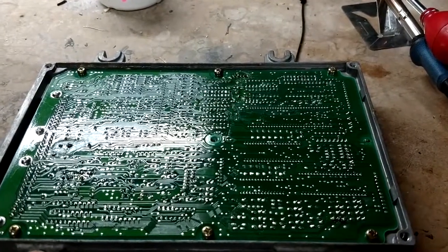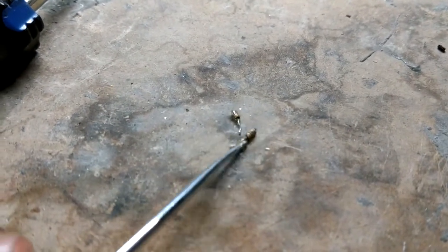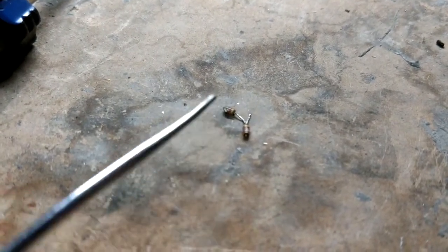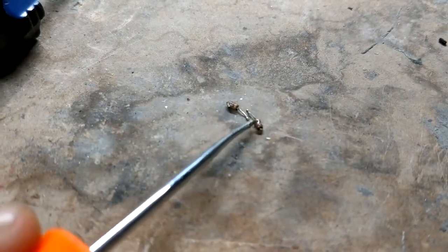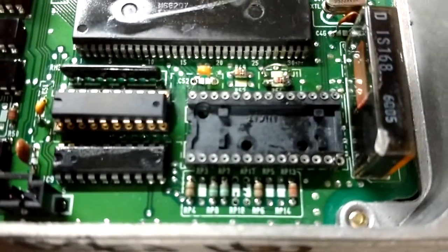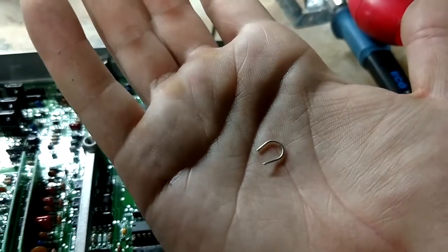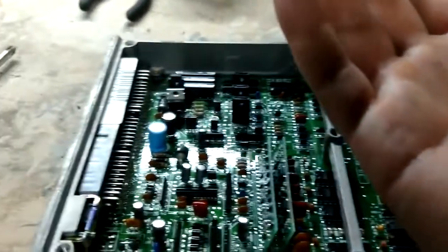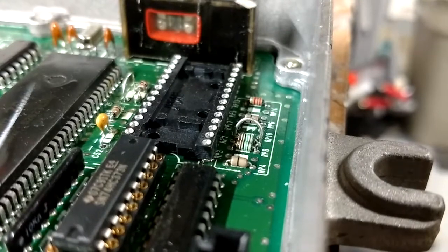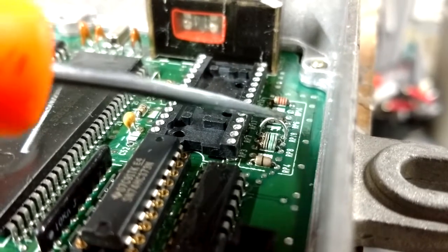The soldering iron has been working great. I'm gonna flip it over and pull those resistors out and do that crossover. Here are the two resistors I pulled out — I actually had to cut one of the ends on each one and then pull them up with a little tool, and then I was able to pull them out with my fingers. This is what I'm going to use to do the loop — it's just an extra pigtail that I cut off one of the other capacitors or resistors that I put on the ECU.